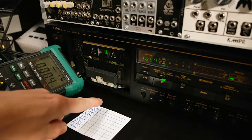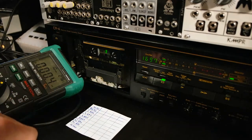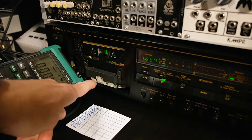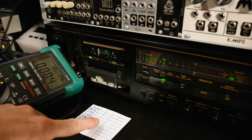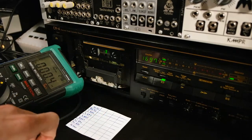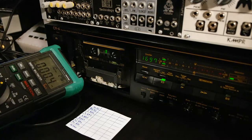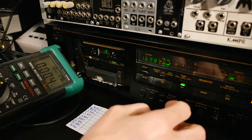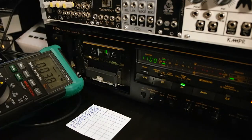So I plan to make a maximum of 4 tests, and let's see. It would be good if along the whole frequency range I get the maximum amount of millivolts, so the maximum amplitude, and this will be my goal. And after each setting I will adjust the record height and see if it's getting better or worse, and where it's getting better and where it's getting worse. This should help me to adjust everything properly without special tools. So I will fire up the generator and hit the record button and pull.